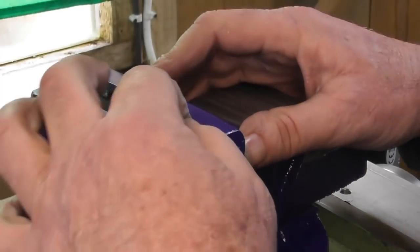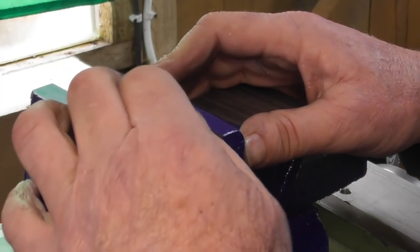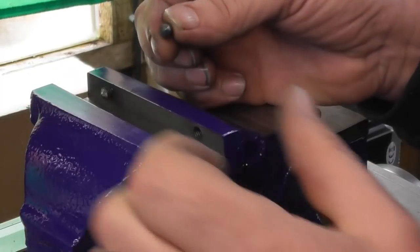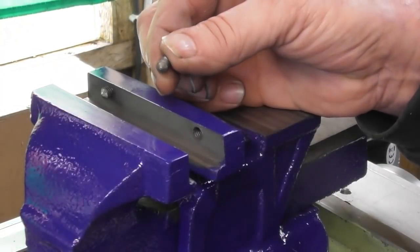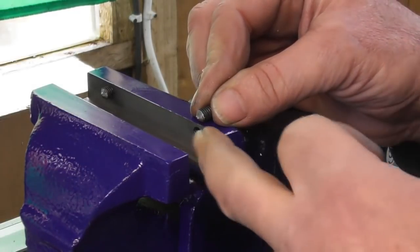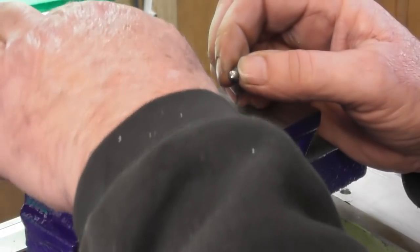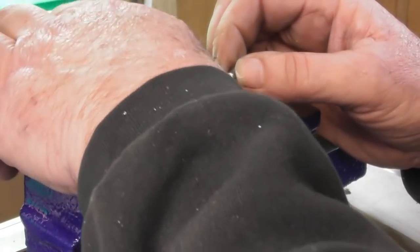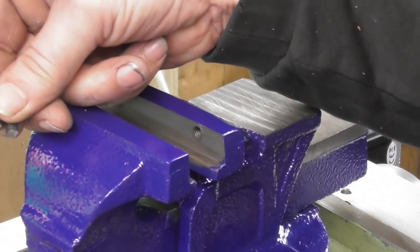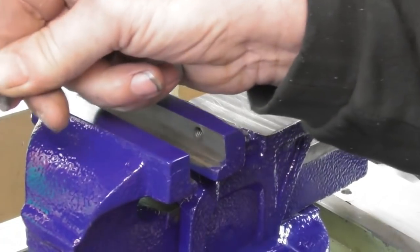And these spot points, let me just show, are nothing more than a grub screw with a centralized point, in this case a ground point on them. You screw them in the hole and then they'll transfer the center of the hole onto the part that needs the aligning hole. I've got quite a selection of these metric spot points. I used to use them on press tools for setting up die sets and what have you, but very handy.